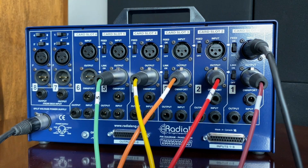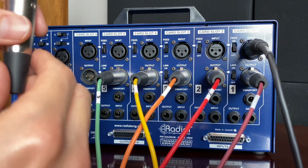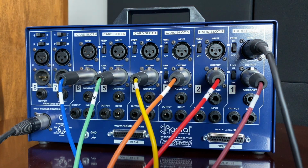And so one thing to look out for is to see how many slots you want and then check how many milliamps are in the power supply. And from there, just divide by the number of slots that you have, and then you can kind of see your average amount of milliamps per module.